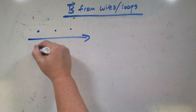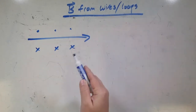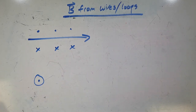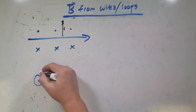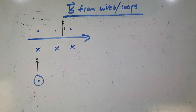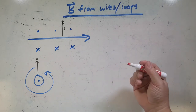So it'll look like this. Here's the current coming this way — let's draw it looking as it's coming at you, from a front perspective. Let's say I want to know the magnetic field at some point above the wire, some distance r away. My field over here, by the right-hand rule, is going to point this way. So let's say I want to know the strength of the field at that point. To do that, I need to use something called Ampere's law.